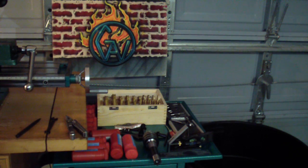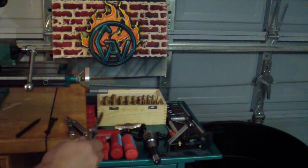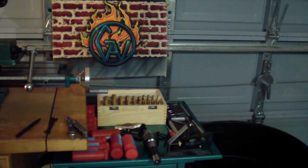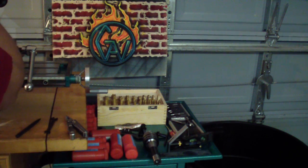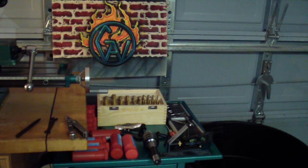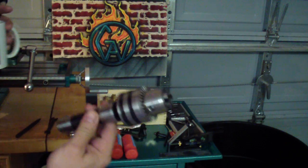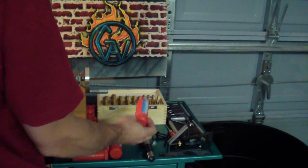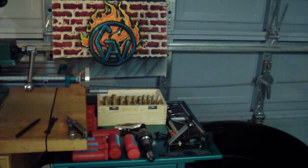And it did work actually good on titanium. This was done with that, and it cut it nicely. I put the speed down, it has enough pressure, the mill has torque, so it cut it nicely without even ruining that bit. I played around with some of those carbide deburring bits, and that worked fine. It came with the chuck, so that's also nice, I can use it as a regular drill. I bought a bunch of these collets. I bought the whole set of R8 collets, that's what this mill is using.